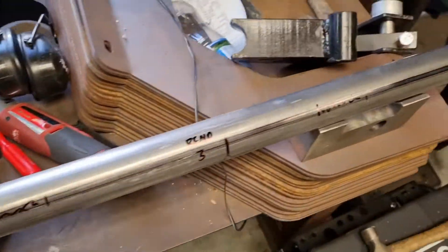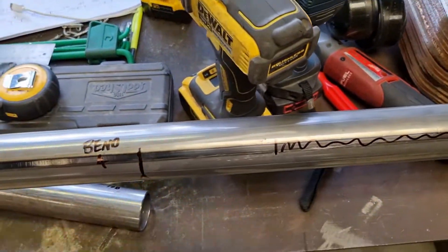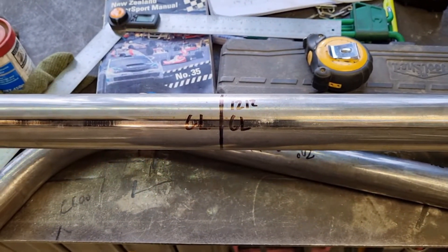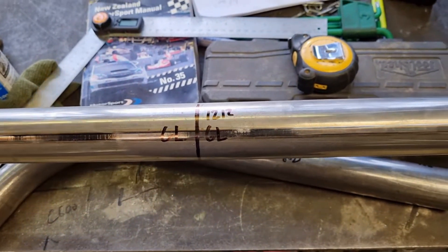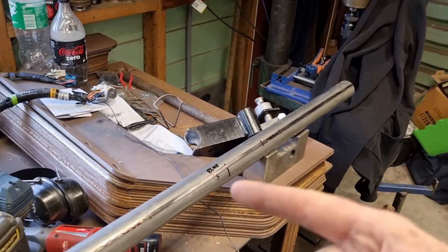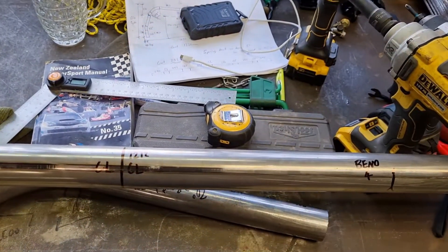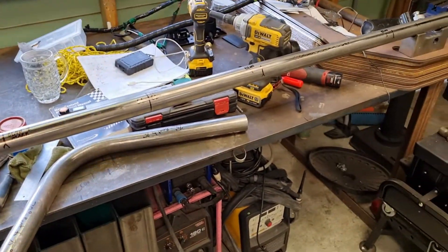Then we mark the rest of them — so bend three down here, working back the other way, and bend four. The ability to make one half and then work from your centre back is great. That means if I decide it's too wide or too narrow, I've given myself a little bit of extra cut length on both ends, so I can move these bends further down or further up depending on if I want the bars further apart or closer together. We'll start bending these up and go from there.